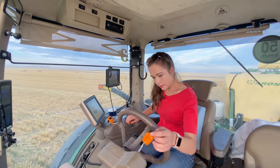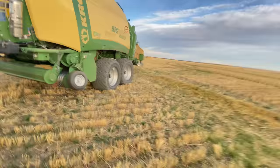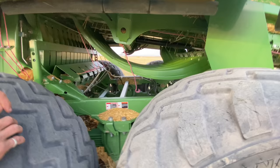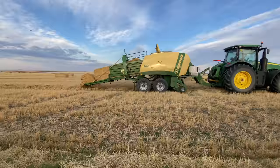Is it something I could have prevented? No. You have twine at the bottom. Most likely it switched from the first row to the second row and the knot wasn't tight enough. So it just pulls off at the bottom — the knot came undone. There's no twine going up to actually do the second knot. This bale fell apart.